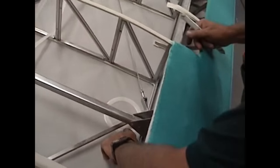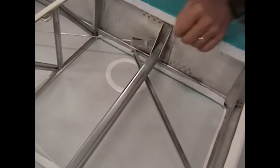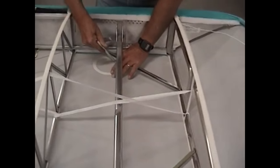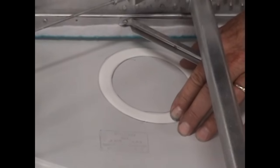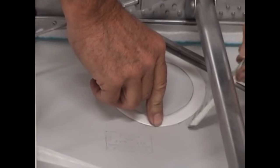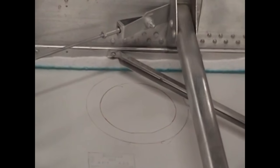To make it real easy, because we can look right through from the top side, we can lay that ring in there and say, where's a good location to put this ring so I've got access to this area if I need to inspect it or do some maintenance? We can look right through the top of the wing, and this pencil mark we're putting on here will show right through the back side of that fabric. Once the airplane's completely covered and we're ready to glue our inspection rings on, they're already pre-marked — we know exactly where to glue them and don't have to guess.